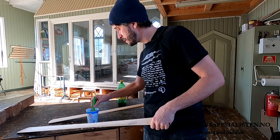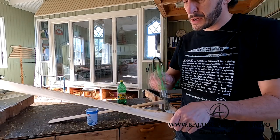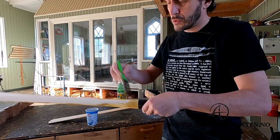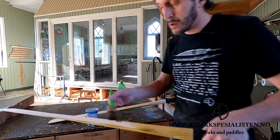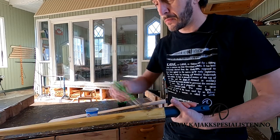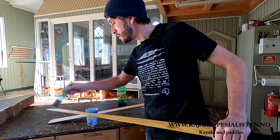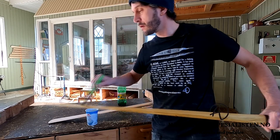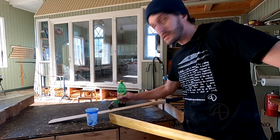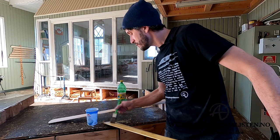You need to work a little fast with the stain because it should look even. That's a nice color — it's very discreet, but I think with the oil this will look just super nice. I just work real fast with the brush so that it can't really dry before I go over it again. Be careful to do the edges, because that's often what you miss. Then when it's all dried and you're ready to oil, you see you missed a spot — and that's very often the edge.